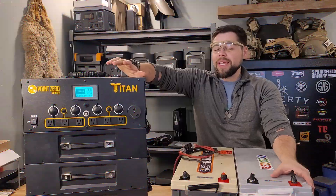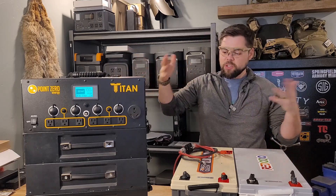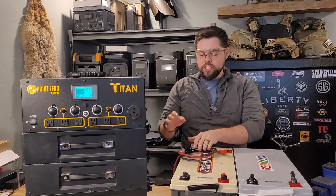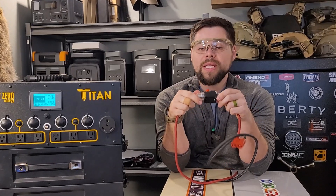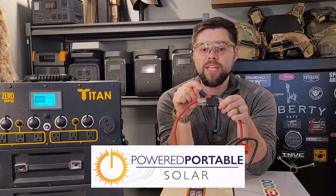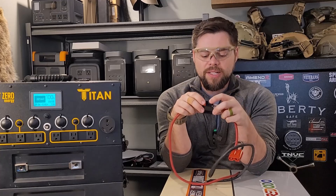What happened last time: I was doing a discharge at a 0.2C discharge rate — that means 20% of the battery capacity draining out of the inverter all at once. The issue I was having was entirely with this breaker right here. It kept tripping, probably just due to heat. I found out that these breakers have a heat tolerance where if they get too warm, they pop, and that is what was causing the issue.